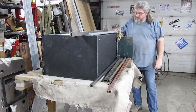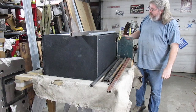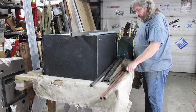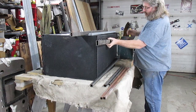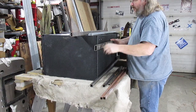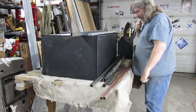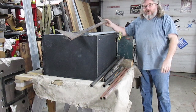I got it up here on my little table and got this about where I want it. Might notch it off for the tires here and bring it down a little bit, but it'll be about three inches off the ground. Go through all your remnant pile and you find pairs of stuff that won't work — wrong size. Then you find that one piece that's awesome, same dimension as what you got going here. I'm just going to come up here and put a cap hook, and this is going to weld up in there and hang off this top lip.